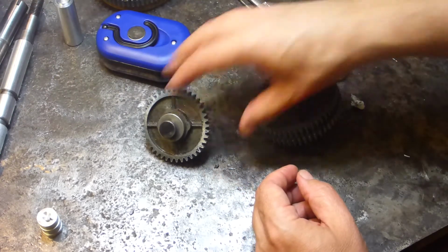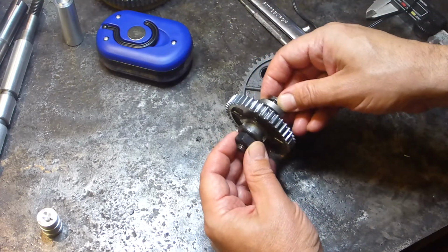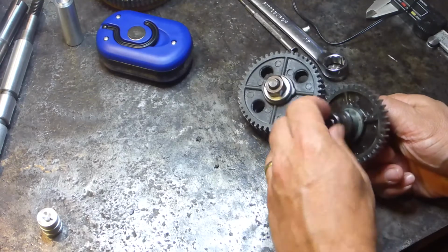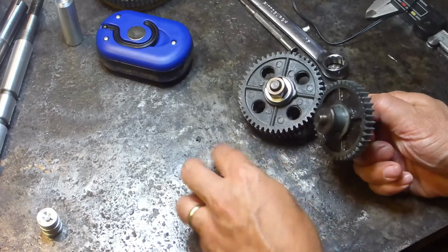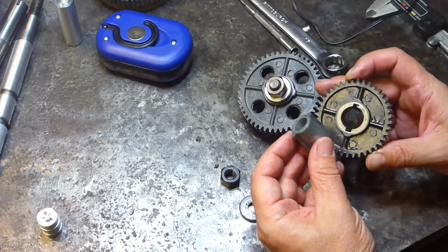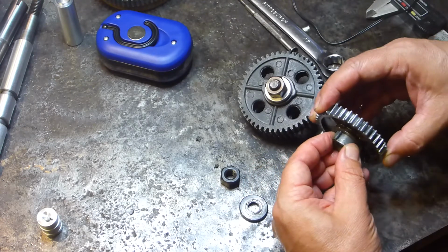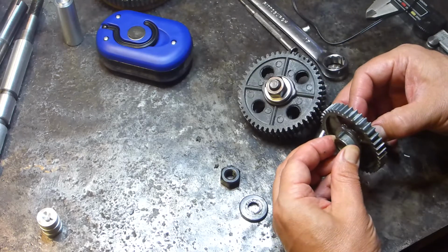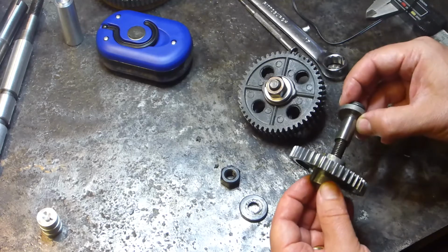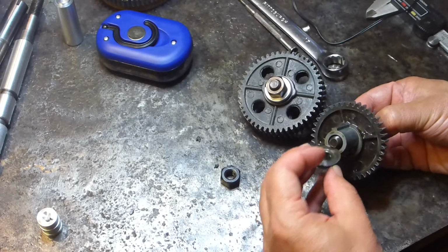Now, these gears that go on the actual banjo, not so easy because they ride on this little slider mechanism here. So if you wanted to try to take the slop out of these guys, you would have to re-engineer this whole apparatus somehow, because a lot of that slop is right there. And that's kind of a big project in itself. Could be done, but I'm not sure it's worth it.